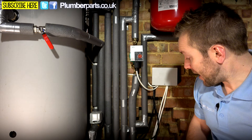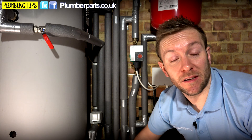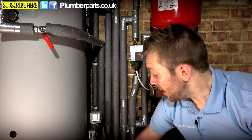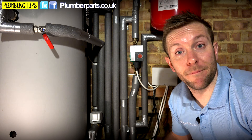On this system here, we've got our flow coming up from the boiler, it goes through the pump and then up. We've got an automatic air vent up there that just vents the top of the pump. It comes back down here — this is an S-Plan system. At this point it can effectively go one of three ways. If the radiators are calling for heat — so the programmer's calling for it and the thermostat's calling — this two-port valve here is going to open up and send a live supply to the boiler and the pump to come on. We've got loads of water coming around there.